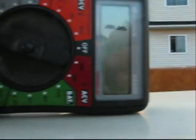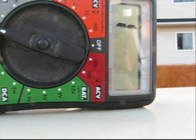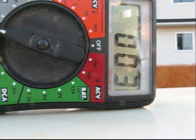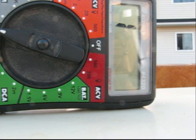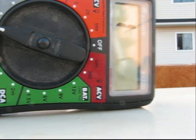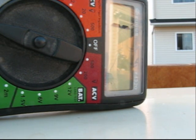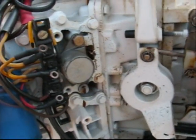I performed a quick test. Normally what's supposed to happen is you get voltage in one direction — the voltmeter is set on diode for this test. We're getting a reading in one direction and also in the other direction, which shouldn't happen. When we reverse the wires, the diode is allowing power to go back through. Diodes should only allow power to go through one way. I've got one wire that is constantly letting power through in both directions, so we're suspecting that part is bad.